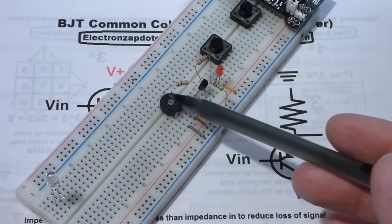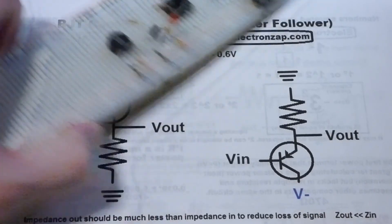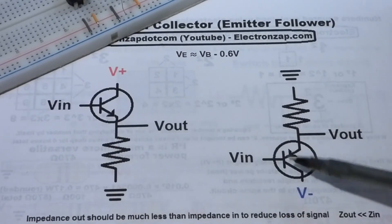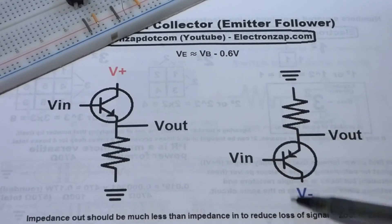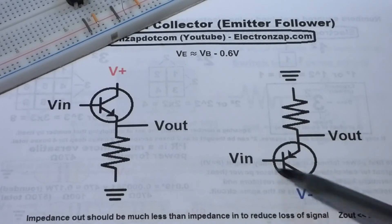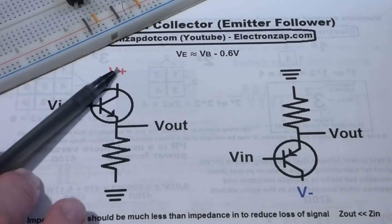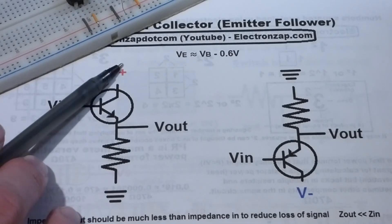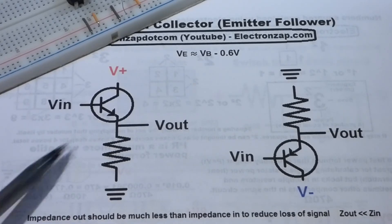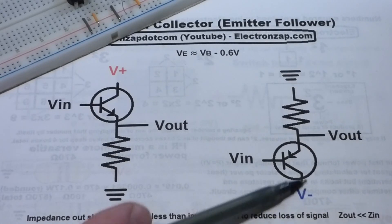You typically use this when the voltage source of the signal isn't strong enough to power something, but it's giving you a voltage you want. This is a PNP transistor used in this video; the last video was NPN because here we dealt with negative voltages. PNP transistors are generally used with negative voltages. In basic electronics, negative voltages aren't used a lot, which is why you don't really learn the PNP transistor as much - you mostly learn the NPN in beginning electronics because you're dealing with positive voltages, say 5 volts down to 0 volts ground. That's why PNP transistors work better starting at a negative voltage, like negative 5 volts going to 0 volts.